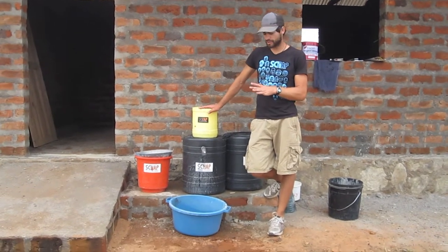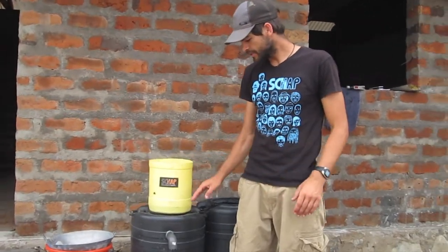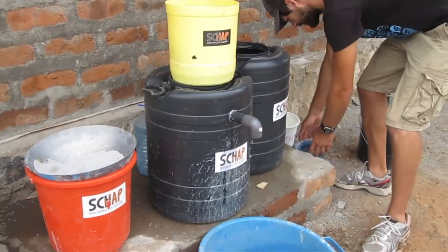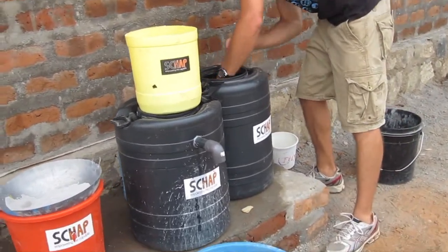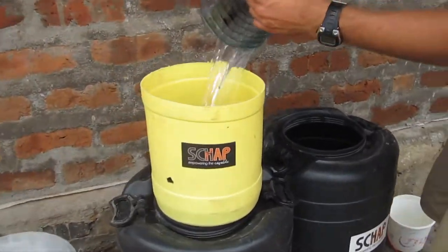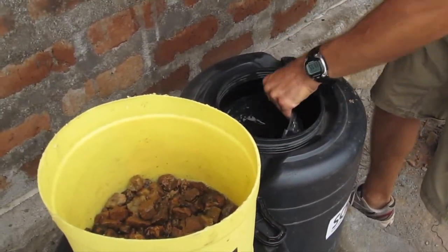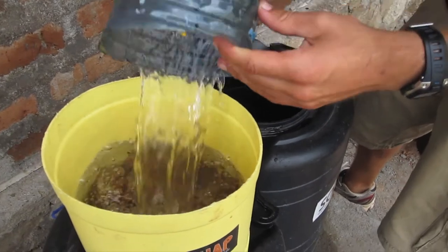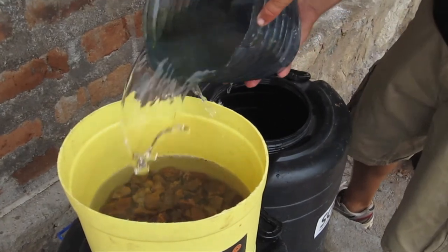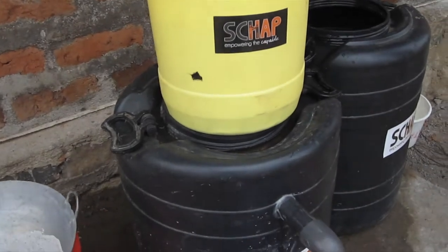What we've got set up here for our school is a very inexpensive, locally constructed, slow-sand biofilter, which filters water to provide clean water for hand washing. This 50-liter drum stays here full of water, and in the morning the teachers will simply put some water into our primary filter as the children are arriving for school. The water will pass through the primary filter, and in a few minutes will start coming out of this spigot here.